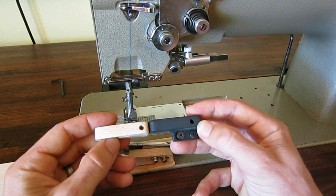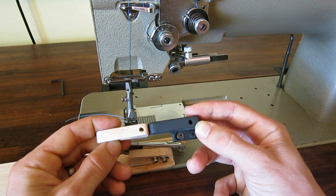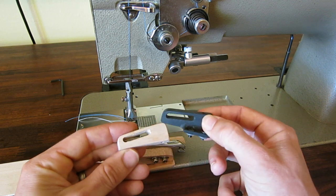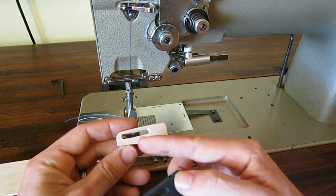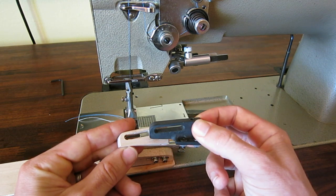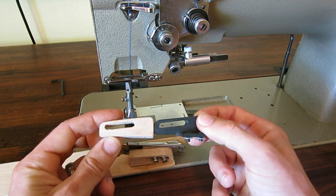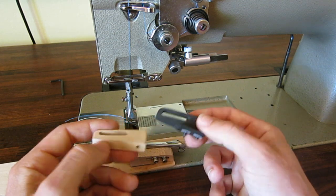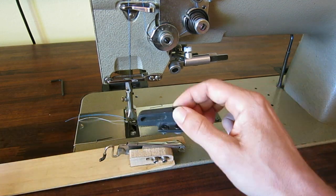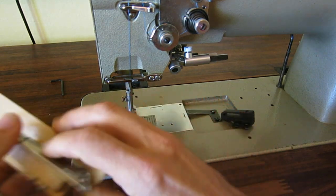Basically, I just measured the width, set the fence on the bandsaw to that width, cut it, traced it, and cut out the shape on the bandsaw, drilled 2 holes the same diameter as here, starting on each end, dropped a coping saw down, and connected the 2 lines. So this was really quick to make. I mean, I made a couple of them within 10 minutes. Then that way I could mount it onto this piece of wood, and I just glued it down.